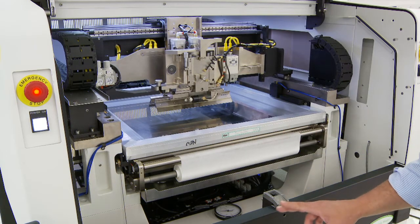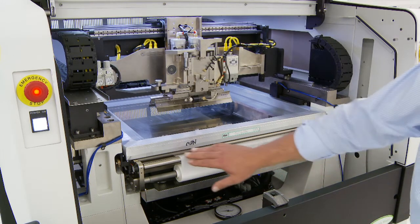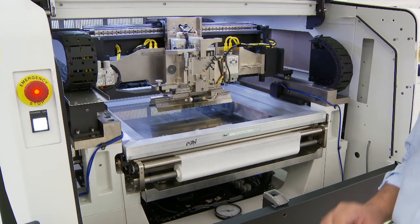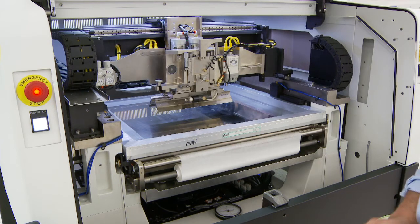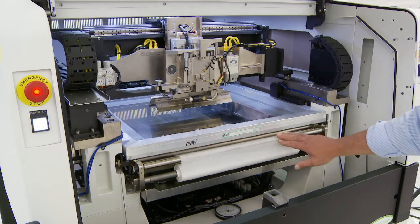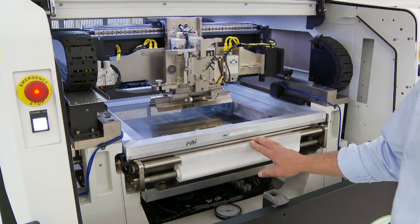We have also incorporated our own vacuum plenum technology. It is composed of 21 turbo injected vacuum venturi valves. Everybody uses a main vacuum pump fed to by a large vacuum tube. The problem with that type of system is reaction time — when the vacuum plenum sees a large aperture in a stencil, it suffers from vacuum loss, and the rest of the plenum bar sees the same loss. What we do is incorporate high-speed, highly reactive vacuum injectors into the plenum bar such that we see a reaction time no greater than 30 milliseconds.